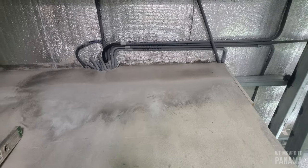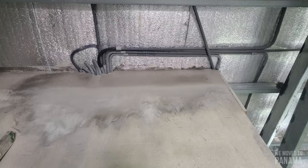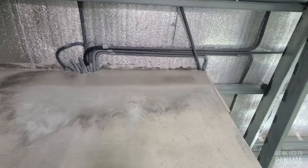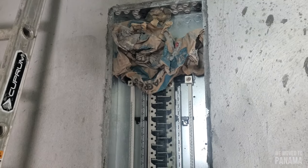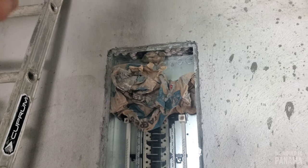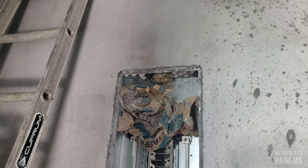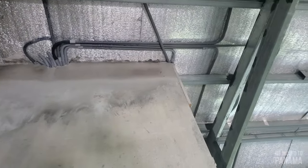And what I usually do, I don't know if you can see over there on my piping, I write "plugs" on it or I put a P on it, and then I write where that pipe eventually goes to. So when I do my writing in the DB box over here, it makes it easy when the electrician pulls the wires and connects them. We know which line of wire goes with what isolator, so you don't get confused. It's always nice to keep track of which one goes where, so you don't have complications later. Just makes your job easier.